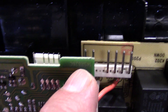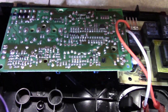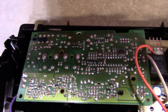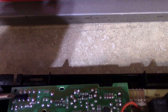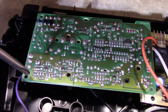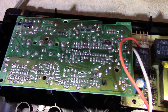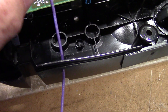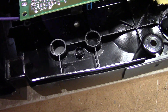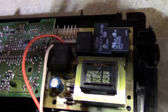The green logic board has three Phillips head screws to remove — one here, one here, and one in the center area on the other side. There is also a purple wire, which is like an antenna wire — you need to pull it through the hole. Once your screws are out and the purple wire is through, the green logic board is loose.